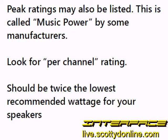Generally, the power of an amplifier should be twice as much as the lowest listed wattage that a speaker can handle. Speakers are rated in ranges — if you look at the back of a speaker, you may see it says anything from 20 to 150 watts. Therefore, that particular speaker would benefit from an amplifier producing at least 40-watt RMS.